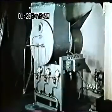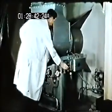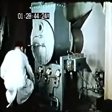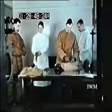Air is removed from the laboratory to ventilate it and to maintain a pressure in the laboratory negative to atmospheric. This air is sterilized by being passed through the air burner, which operates at a flow rate of 2,000 cubic feet per minute and at a minimum temperature of 320 degrees.